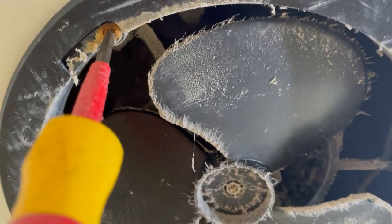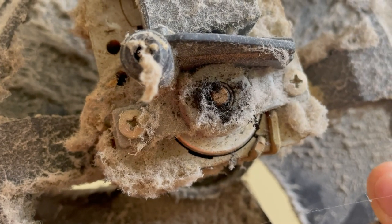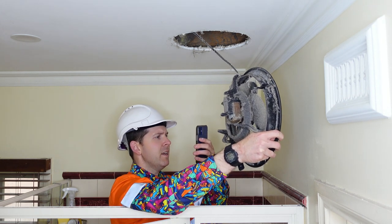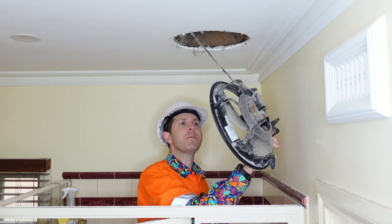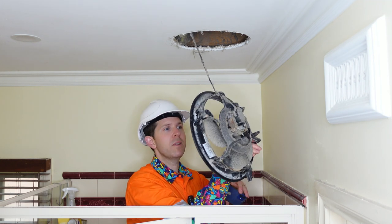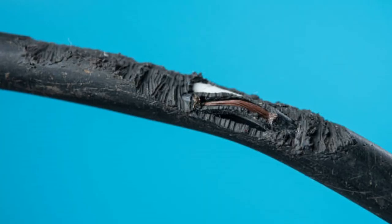That is the bearing that sits on top — no good. What you want to do if possible is find the nameplate and take a photo of it. Let's get this sucker down. Like I said, it's directly connected to a socket — most of them are plug-in these days, so you've got no issues with live electrical stuff. But check this out: you have no idea what's in the roof — here's some electrical cables that could have been nicked by the fan.